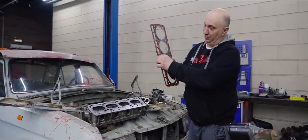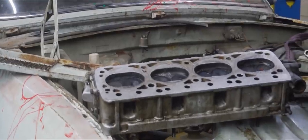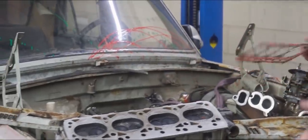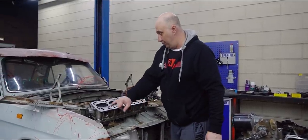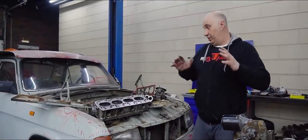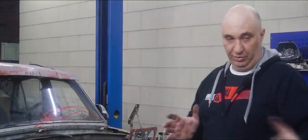So right here I have the head gasket that we installed — since it was only for 10 minutes we did use a sealant. Now when pouring in water, as soon as it goes through these channels it immediately begins to leak from underneath the head and drip down the engine block. This tells us that the cylinder head is warped. After giving it a quick rub, you can see that here something is happening while here the metal is completely unscathed. That glass is naturally as smooth as it gets. The problem is you can't use really thin glass — you need at least 5, 6, 7, 8 millimeters. When a cylinder head gets warped it is very difficult to straighten it back out again.